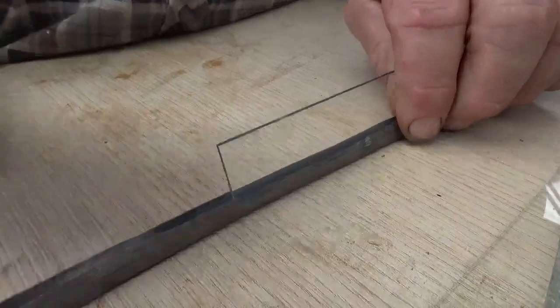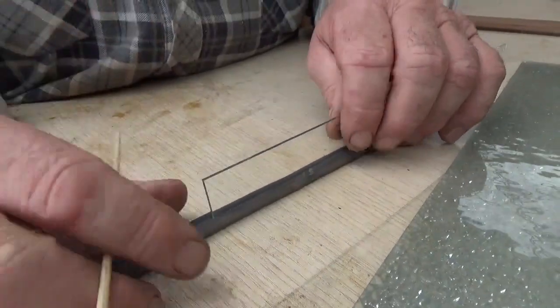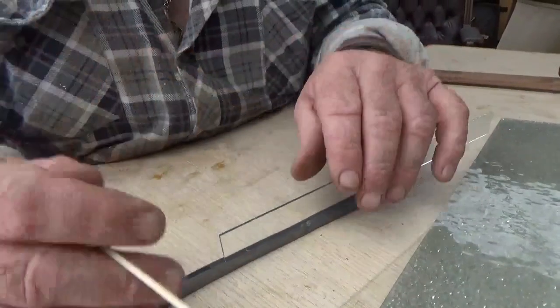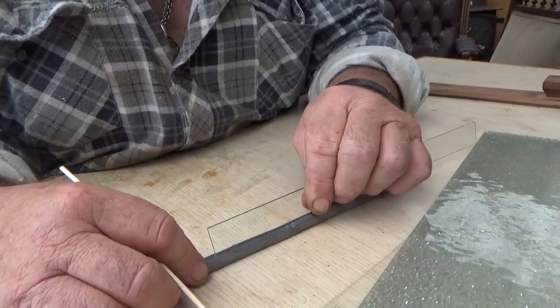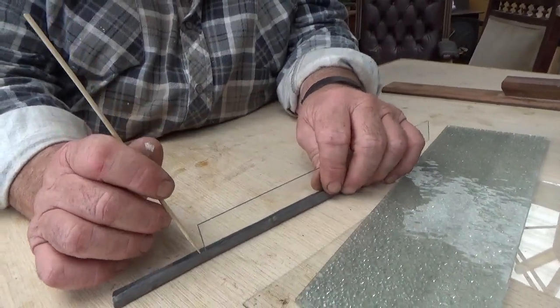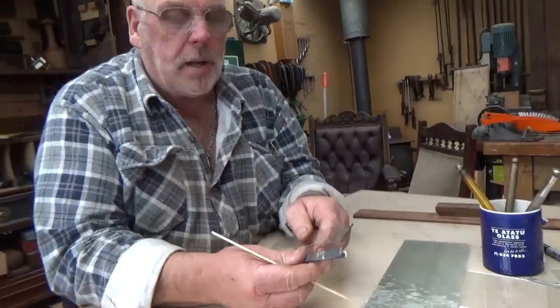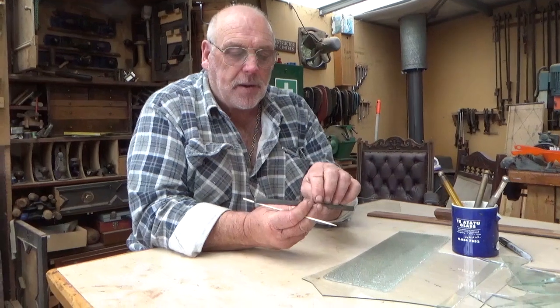You've got to cement the glass to the lead, and that stops it rattling and makes it waterproof, of course, for the rain and so on. So with too thick a glass, you won't be able to cement the whole thing in place. You can use either your own made cement, or good old putty. It does the same job. That's why you're governed by the thickness of the glass. You have to have that space.